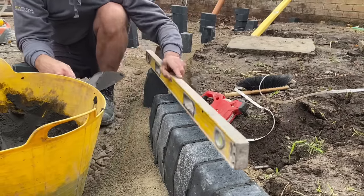To the step now, so we're going to do a semicircular step to hold these arches on the door. So I'm going to be forming them with key curves now. But if you just look at the size of the gaps there, even though we're going to point it, what we're going to have to do is cut every other one down to a taper to lessen this joint here, because I want 10mm max on that. So I'm going to be cutting those down and then I'll put them in.